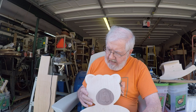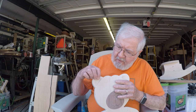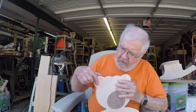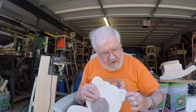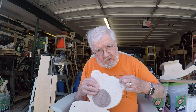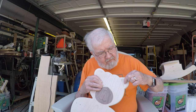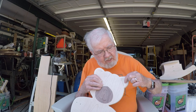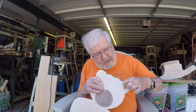On the ears, I've used small chisels — I scribe a line and then use small chisels to work my way down to create the hollow for the ear, then sand to get rid of the chisel marks. I mark the line with a pencil, scribe it with a straight chisel, and then gradually with a curved chip carving chisel I work gradually deeper and deeper, honoring this edge. Then I usually have to deepen this cut once or twice, and sand it smooth.